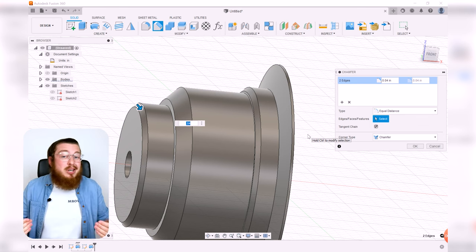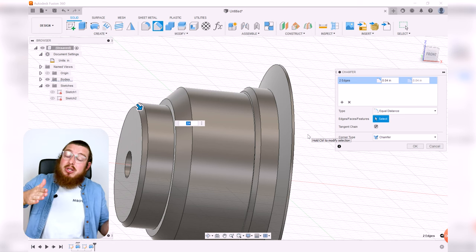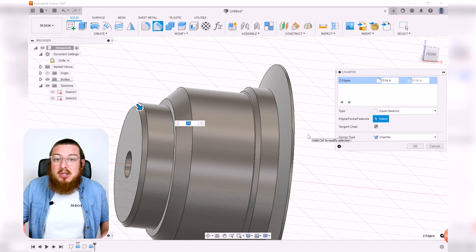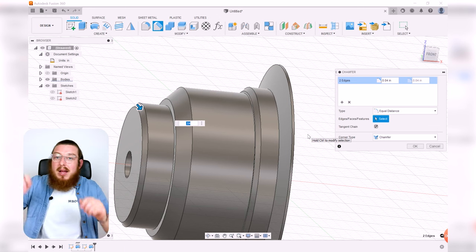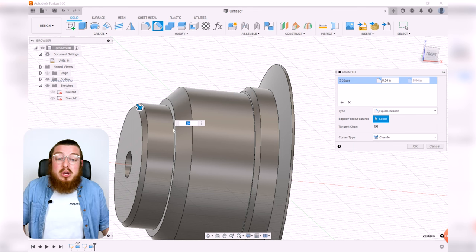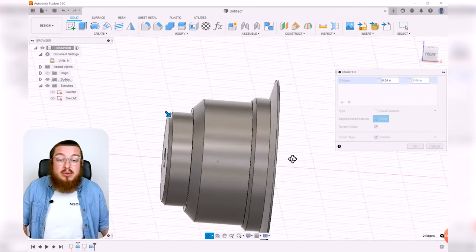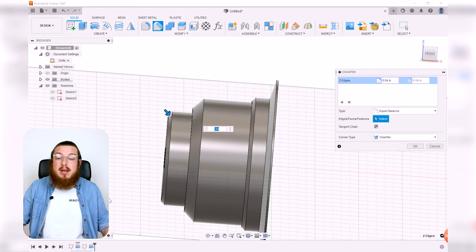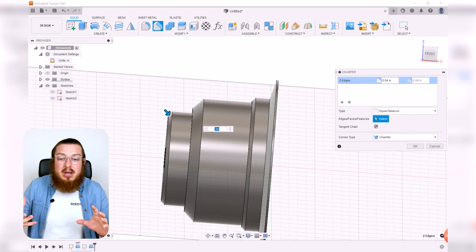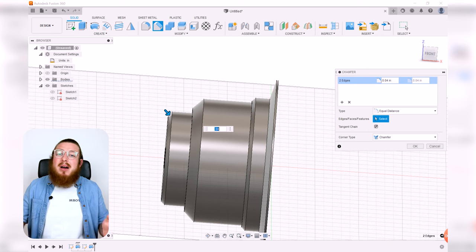You can denote this in saying, yeah, this is its dimension, or it's just a light chamfer. And that's kind of telling the manufacturer, yeah, it's not any specific dimension. It's just making it kind of light so that you don't have a sharp area that'll cut your hand. We could have also put this as two separate 45 degree angles in the original sketch. But again, that just adds more and more dimensions and it kind of crowds out the entire sketch. It makes it a little bit harder to see what's going on.